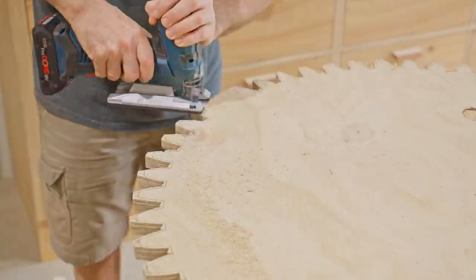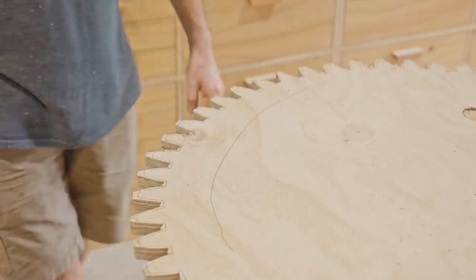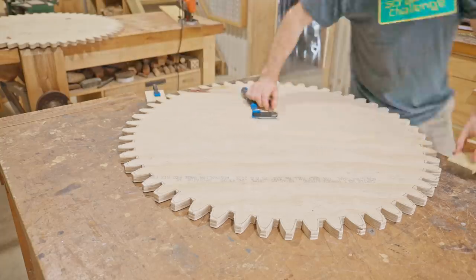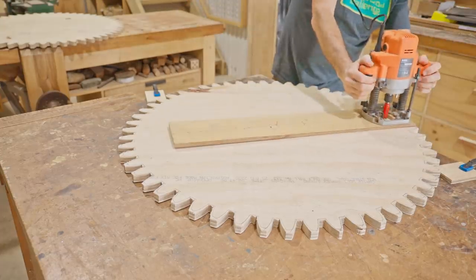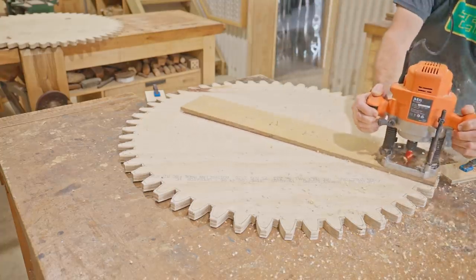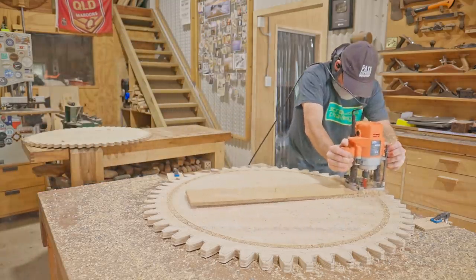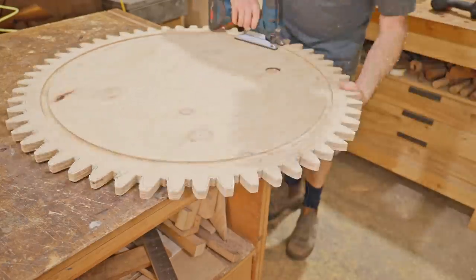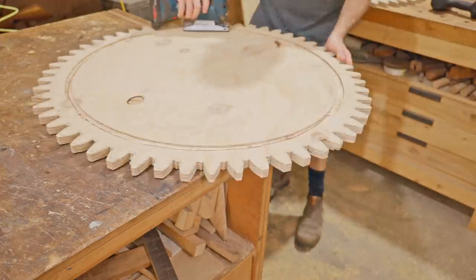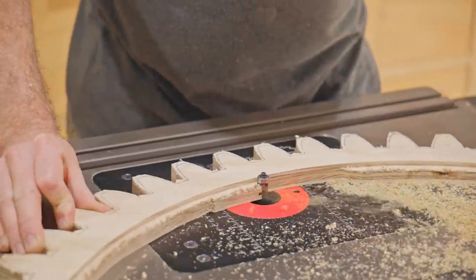That's the teeth cut on these two layers, and these ones don't have openings like the first two did — instead they have one big opening, which basically makes it a ring. I'll cut the inside of the ring with a router and a circle-cutting jig. After making one pass about five millimeters deep I'll cut it out with a jigsaw and finish it with a pattern-following bit. I left more material on there than I needed to, but it cut easily enough anyway.